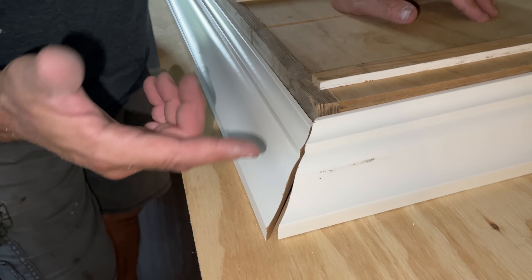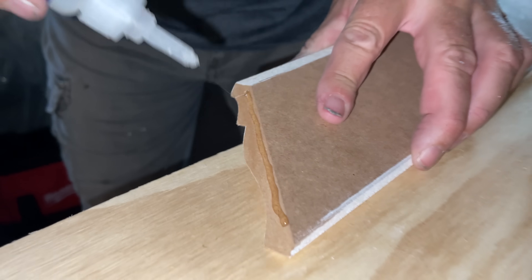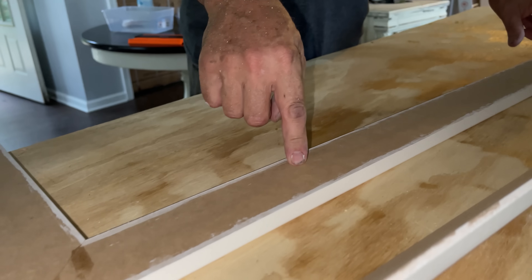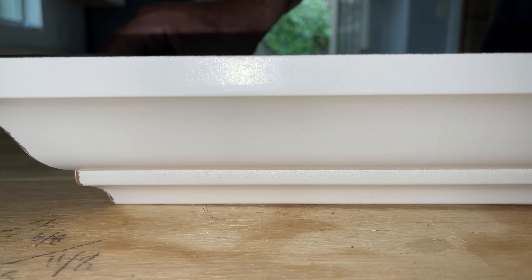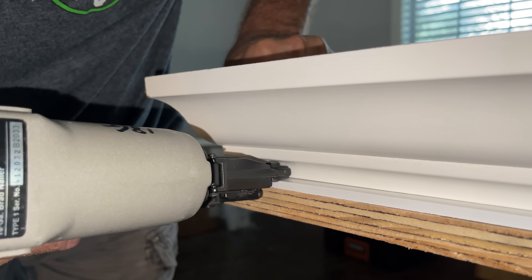We've got our pieces cut. Now it's time to glue them together. I needed a 90-degree reference right here to get a perfect miter, so I just took my crosscut sled from my table saw, turned it upside down, and that's going to work perfect. We're going to glue it just like that — let me get my 2P10 ready, we're going to glue up this miter. We've got our crown cut and assembled, our nailer cut and assembled. Now we need to pick this up a little bit to get our 3/16-inch reveal. I'm simply going to head out to the table saw and cut some 3/16 shims. Perfect 3/16 reveal.